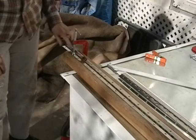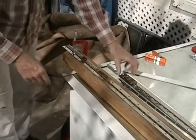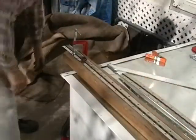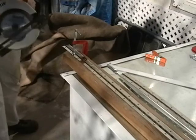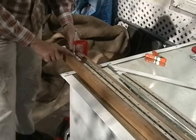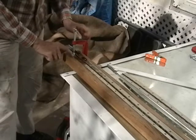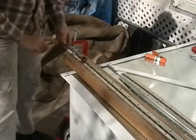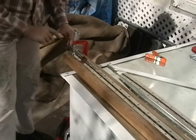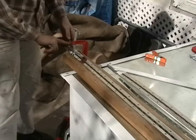I'm trying to cut off the hinge for the reflective panel and I did do that. I changed my power saw blade to a carbide and hooked the piano hinge off to a 2x4 with a locking C clamp and extended that over my work surface and then cut it. I found there was a lot of movement and it wasn't quite as nice and straight as I want.